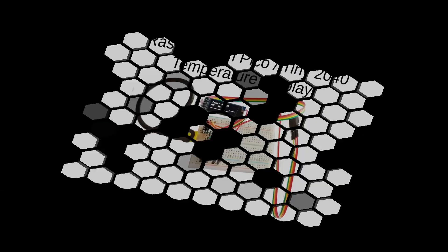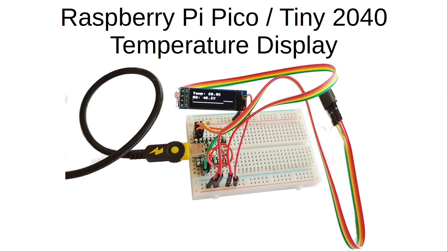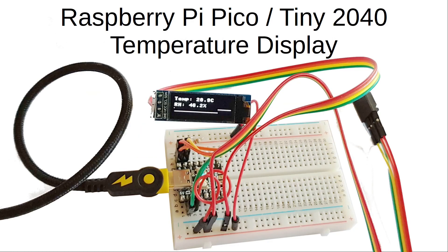This has shown how you can connect multiple I2C peripheral devices to a Raspberry Pi Pico acting as a controller. It reads the temperature from the AM2320 sensor and displays this on an SSD1306 OLED display. Both devices are on the same I2C bus and are referenced by their address. Unfortunately it's not possible to use two AM2320s or two SSD1306s as they all share the same address, which would otherwise conflict. I hope you found this video useful — if you did please give it a thumbs up and a share. I'll be creating a future video on OLED displays with Raspberry Pi and more Pico projects as well.